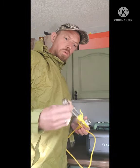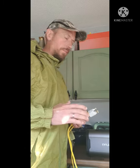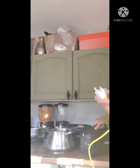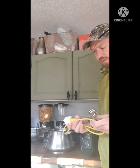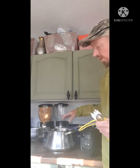I've been trying to come up with a hot water solution in my van for taking showers, but I also wanted it to be portable and something I could take outside or use in the van. I came up with a solution using a cheap Chinese heating element - this is a 600 watt heating element. It's actually pretty good quality; I've tested it already and the cables don't overheat. This is five liters of cold water.